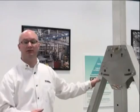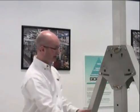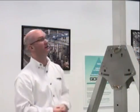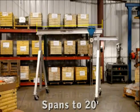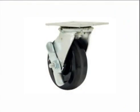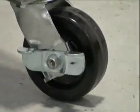The next thing is adjustability and flexibility. You're not going to use this crane in the same application every time — it's going to be moved from place to place, so it needs to be adjustable in height. There are two pins that can be pulled out on both sides and the entire crane can be lifted up very easily. We also have an option that assists in adjusting the height. It's also an adjustable span — you can make it smaller or wider up to the maximum width of the beam. The maximum standard design is a 20-foot span and it comes up to a two-ton capacity. We also have locking casters on the bottom, since the crane won't always be used on a perfectly flat surface, so the casters lock in place to prevent any drifting or movement during use.